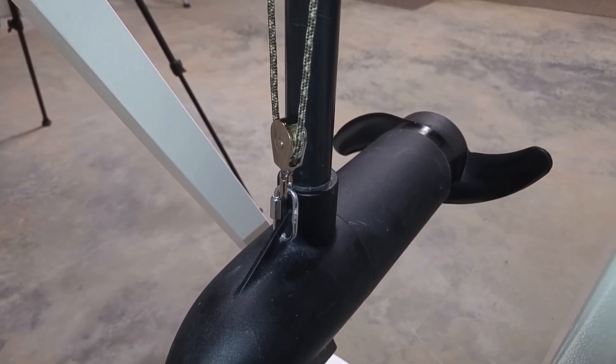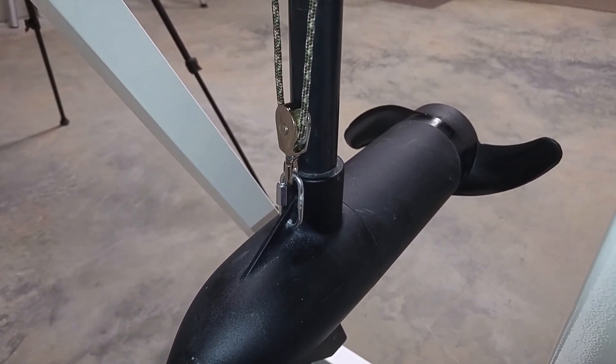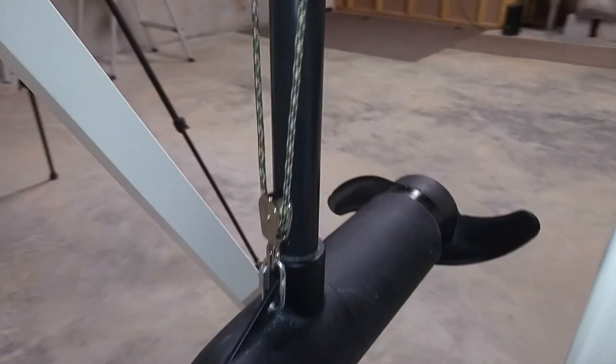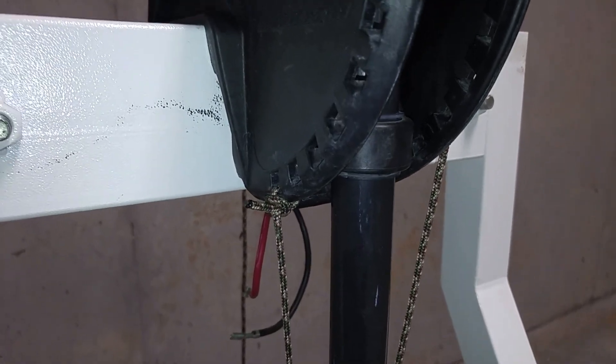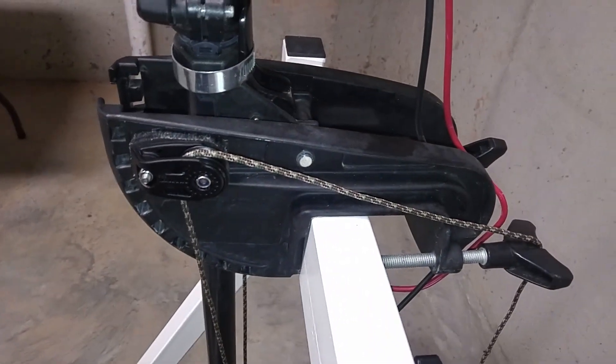I know I've skipped some steps, but they're pretty easy. What I did was I connected the quick link to the gusset hole that I drilled previously, then attached the stainless steel pulley. I also threaded the paracord, which is going to be the lifting cable. On this side I threaded the paracord through the last hole in the bracket, and that goes down through the pulley, then up through the Harken pulley, ready to be pulled. The important thing is that the V-shape in your cord gives you a lot better power to pull up the trolling motor.